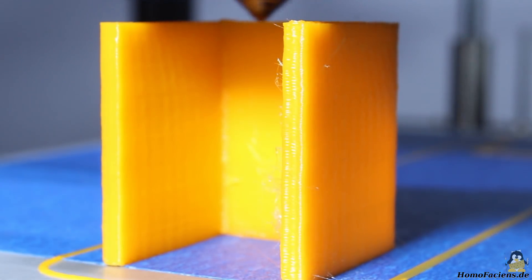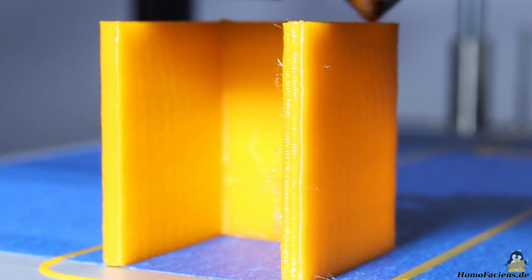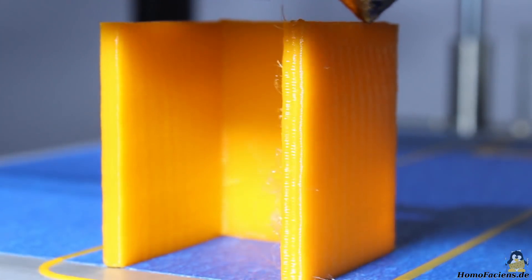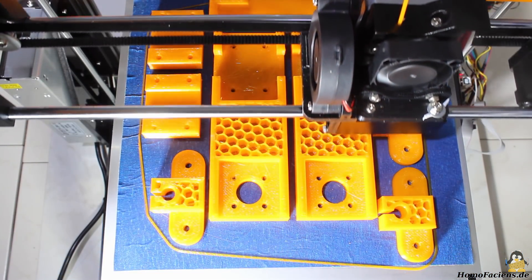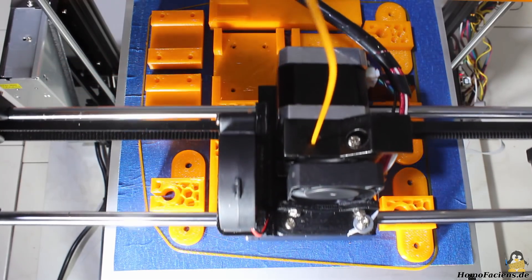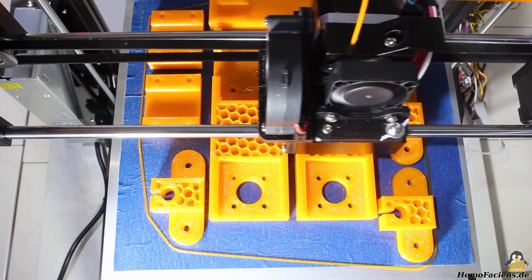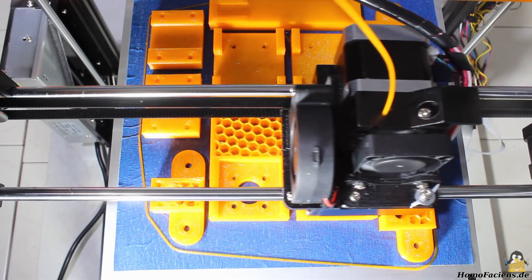I had a closer look at the Z-axis mount with my next print job. As you can see, the build plate vibrates resulting in ripples on the surface of the print. The mount of the print bed is too weak. I always say that 3D printers are great machines for prototyping, so let's go to the virtual drawing board and create a new mount for the build plate. My first idea was to place the round bars on the sides of the frame to get a better relationship of the levers.